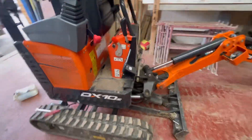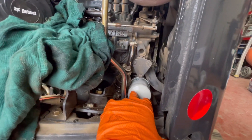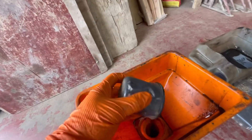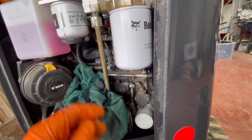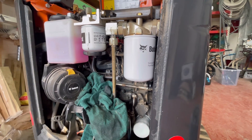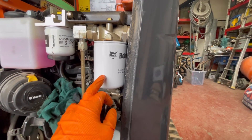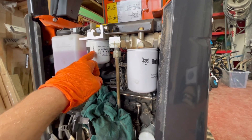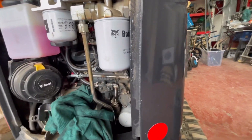I've got to my DX10 service. We've had it running for a couple of minutes and drained the engine oil — I've put a bit of cardboard down to stop it going on the track frame. As expected with a first service, the engine oil filter was seriously tight — it took a bit of busting off. It's sat up between two services: first service would have been 50 hours, and the second is 250. I've changed the engine oil filter, done the hydraulic filter which is due at 250, and I'll do the fuel filter as well.